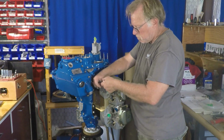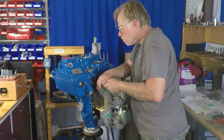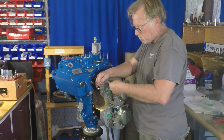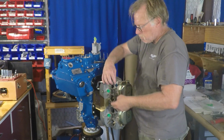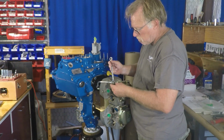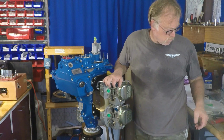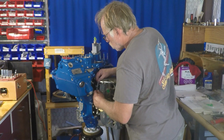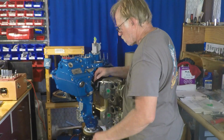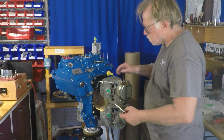And then the tubes typically are in pretty good shape. I don't know if we bought new ones for this engine or not. Sometimes when you buy a new one, it's very, very close. But they're just 5052-O aluminum, and you might have to give them a little bit of a nudge to get them lined up exactly. Most importantly, before you tighten the lower hose clamps, tighten the B-nut on the cylinder. Make sure that's all lined up, because it's harder to get that aligned than it is to get your clamps aligned on the bottom. So pretty much just nut driver.